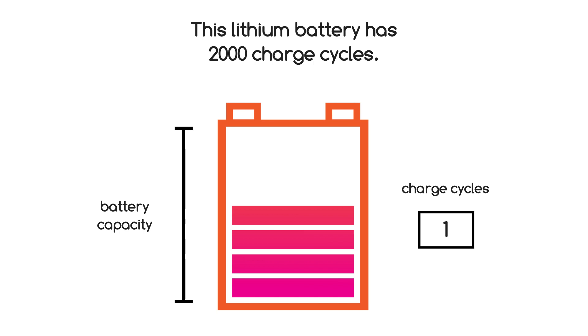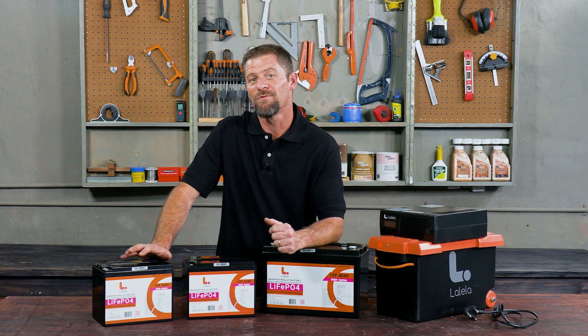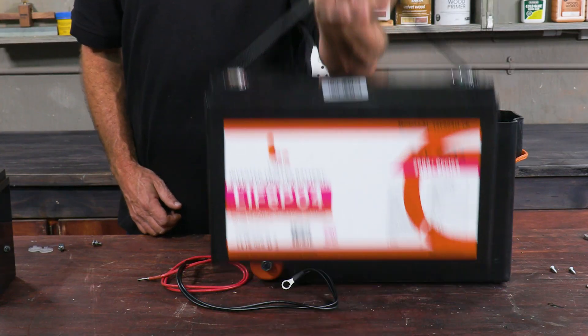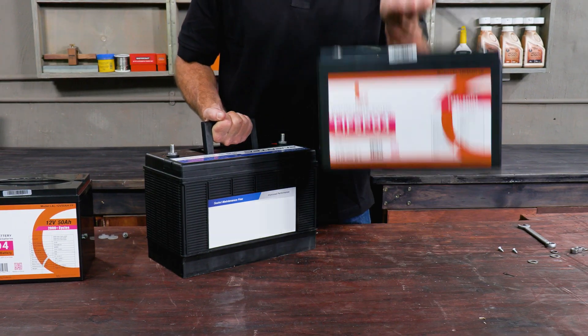Charge cycles on lithium are cumulative — you need to cumulatively drop the battery all the way to 0% before a charge cycle is registered. If you were to run this battery flat every day, you've got about a 2,000-cycle lifespan — that's five and a half years. If you were to drop it to only 50%, we're looking at a staggering 6,500 cycles — about 17 years. Another advantage is that lithium-ion batteries, including the large 80 amp hour, are considerably lighter than lead-acid.